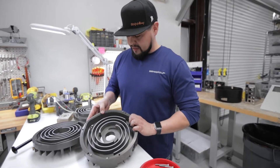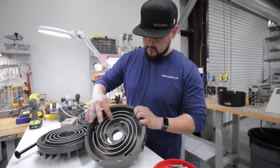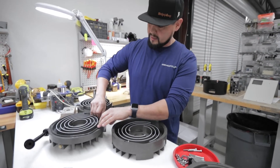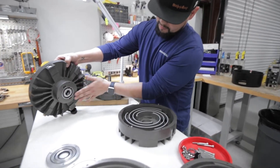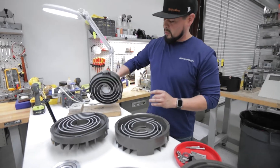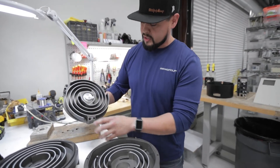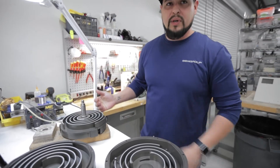After we break down the pump, we'll clean everything and replace the bearings, replace the tip seals, and replace all the different o-rings located throughout the different areas of the pump that go on different sealing surfaces. This is called the orbiting plate with the crankshaft, and we rebuild everything all the way down to the needle bearings, the shaft seals, and the crankshaft when needed.